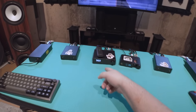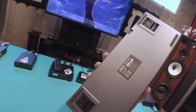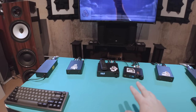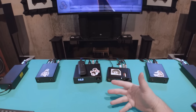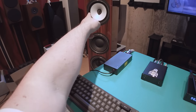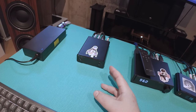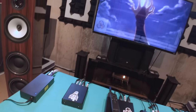Back to the amplifiers — or the DAC or the Flamingo or this keyboard, which is the Epomaker EK68 by the way. Let me explain to people who have no idea what they're watching. I'm Zeos, I do reviews on audio stuff — I've been doing it for years. These are power amp monoblocks. That means one channel, that speaker gets one amp. The fact that it's a power amp means there's no volume knob on this — there's a gain switch for the RCA, that's it. Whatever is being fed into this gets amplified to the maximum.